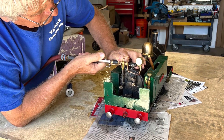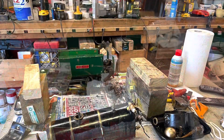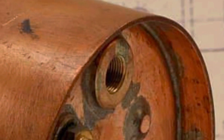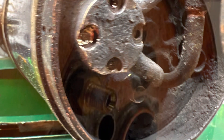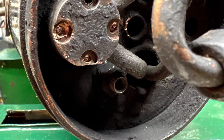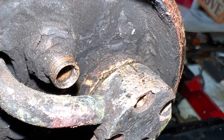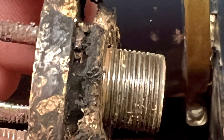This necessitated taking off the smoke box and doing some more extensive digging, and also removing the boiler from the locomotive. With the two separated I knew I had much more work ahead. Looking at stock pictures from the internet of the boiler fitting, I was trying to get an idea of what I had to deal with. I tried to remove the super heater, but of course the steel screws inside the bronze super heater had made that impossible. So that necessitated drilling it out — and the drill bits unfortunately chose the softer bronze rather than the hard steel screws.